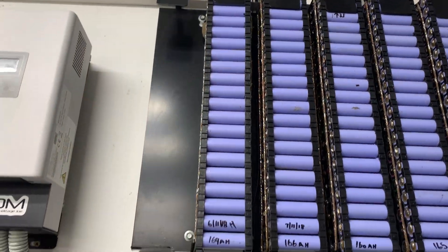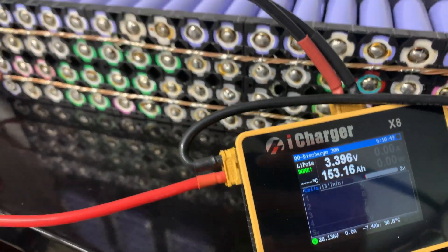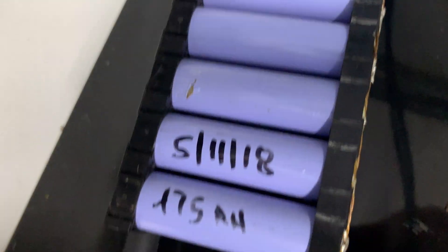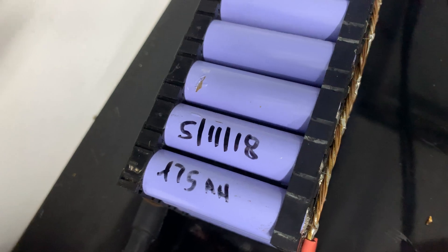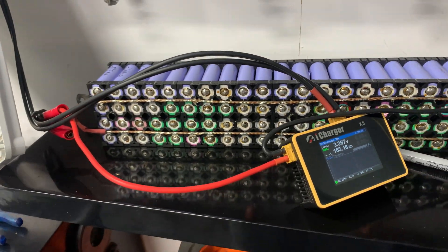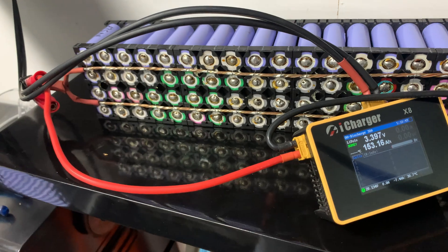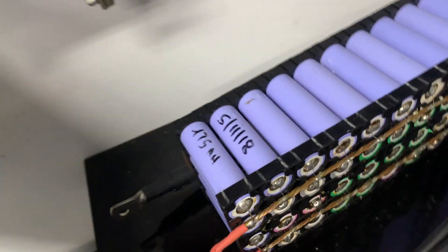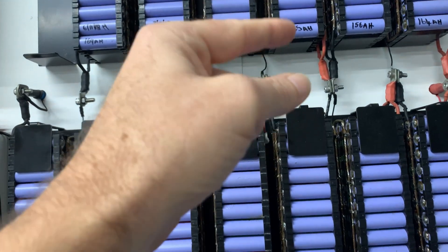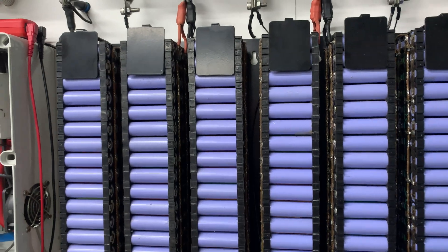I'm glad I actually took the time to do that. I'll pop that cell out. We've got 153.16 amp hours. I did it the same way as I did back in the day — I haven't got the balance lead, and I charged and discharged it without that. So going back to the label: that's in the 11th month of 2018, and it was 175 amp hours. So this has lost about 20 amp hours as well, which is kind of consistent with the other one. Maybe that's what we can expect throughout the years. This battery hasn't been used anywhere near as much as the house battery where the other one had come from, so there might be slight differences. But I know this battery is built from recycled cells from the house battery — so anything that was weak down there came out here and I swapped it out. I sort of keep reusing the recycled cells, so to speak.